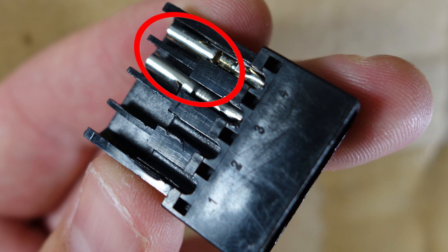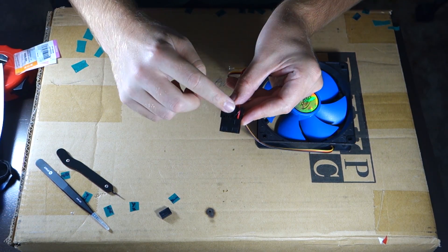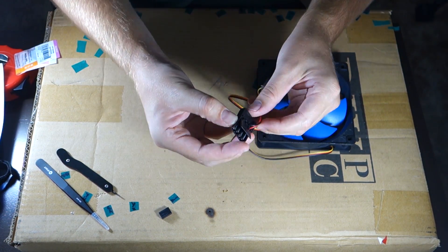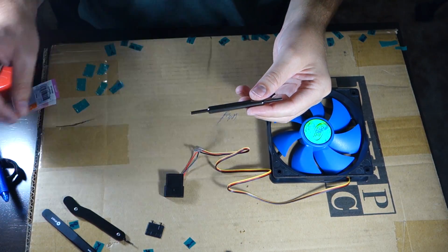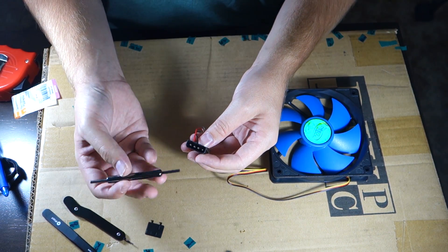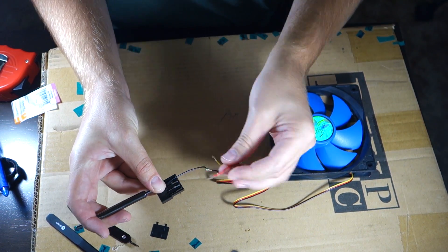This is what the inside of the Molex piece looks like — the bottom left end from the previous photo is what you're seeing, so you can understand it can pull right out if not for the other end of the connector. On top of the Molex piece sits a little hinged plastic door, which should be easy to remove and put back in place as long as you don't break it by putting too much force on it — I'll show you right now as I pop this end right up. You can see it kind of sticks on there still, and with a little force you should be able to maneuver the plastic tabs out of the connector. For the actual wire pieces, you're going to want to use this tool, or some people have mentioned using a pen. You'll use your tool on the covered part of the Molex piece to maneuver those pins, and you should hear a little click and then it should pull right out.